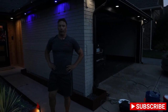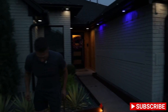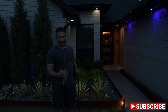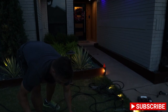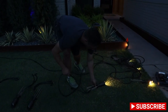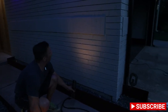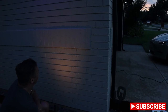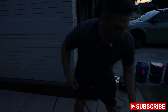Now for bigger trees and bigger items you might want to shine with different types of light. This is an MR16 at 2700K and 1.5 watts, so it's not going to be super bright. You can see it's a nice light but it's kind of a yellowish light — we're shining onto a gray brick. It's only 1.5 watts so it's a soft light. What I like about these is so many different variations depending on what we're trying to light up.